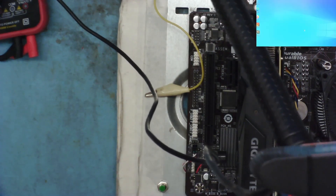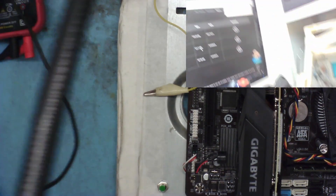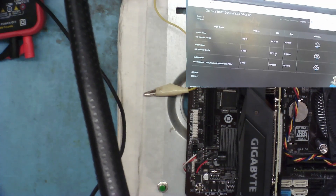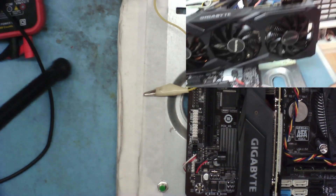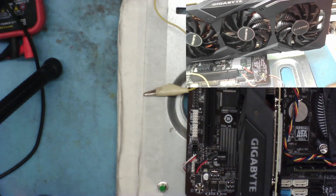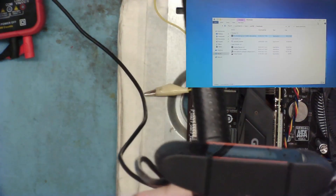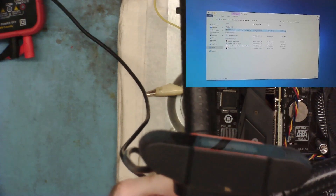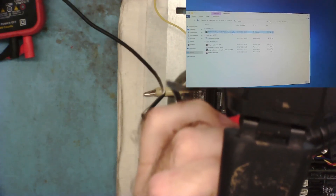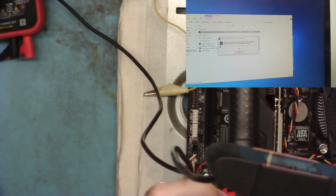I need to load the latest drivers for this graphics card. While downloading the driver, the screen glitched, went blank, then came on at a higher resolution - it looks like it actually downloaded the driver itself. The fans stopped running at that point - not sure if that's normal but the PC is still working. I'll go ahead and install the driver from the Gigabyte website for this card, the Windforce 8-gig. There may be later drivers on the NVIDIA side but let's try the manufacturer's version.